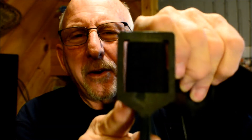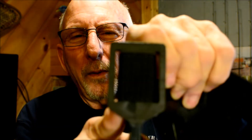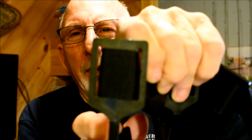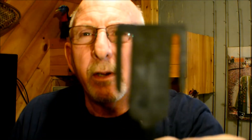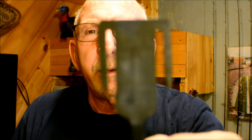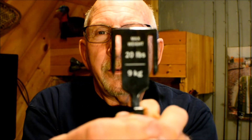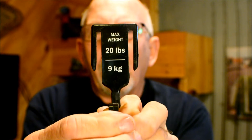Let me show you what I did. If you look on the backside of these hooks, there's a corner right here — if you take that corner and, with a hacksaw, make a straight line straight down and cut that corner off, what you end up with is the same hook only with those little nubs cut off.